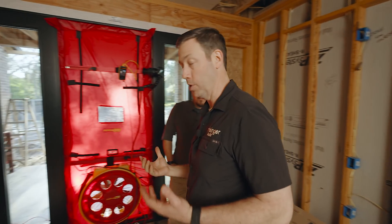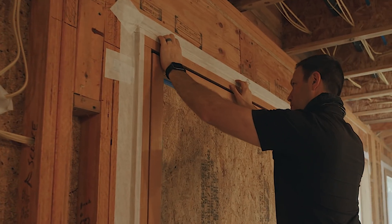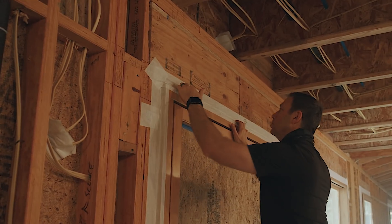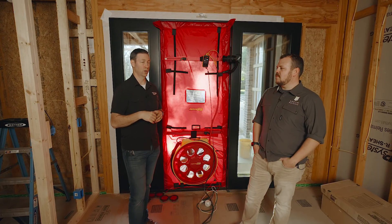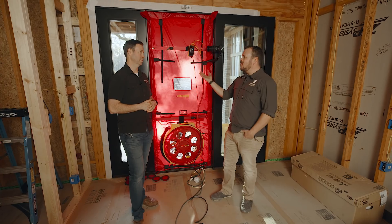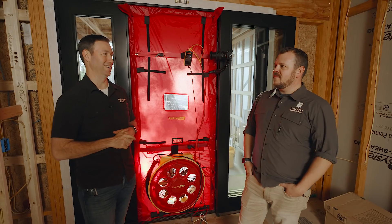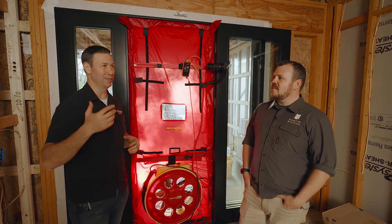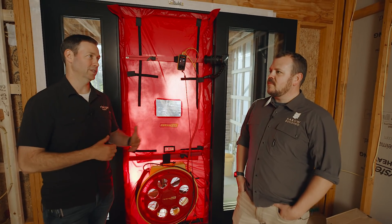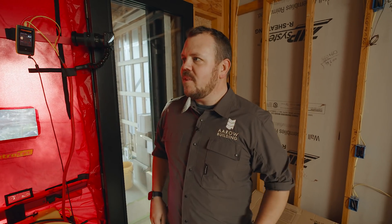You've got to really think about how many operable windows and doors you have in your house. When we walked around, we saw some leakage around the operable windows, but the fixed windows — really no airflow through those. So the more fixed you are, the better off. And if you look at your climate, how often are your windows open? Almost never. There are almost zero days a year that I want my windows open because even if the temperature is okay outside, usually the humidity is high. Closing that window metaphorically on your envelope increases your control — huge — and it's all about getting control.